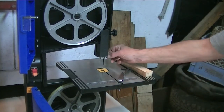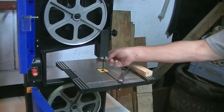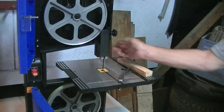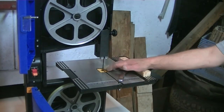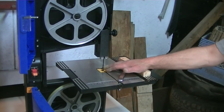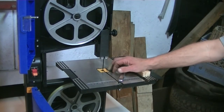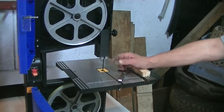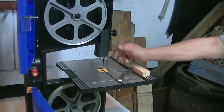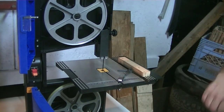And these little finger joints will wear over time, so you have to keep an eye on them and adjust them once in a while, because if everything else is good and you're getting bad cuts, like it's not cutting straight enough, then these have probably worn in. So I would suggest running maybe a few days worth of cutting with these settings, and then going back to double check and retweak them, because these pins have to break in. Check all three of your settings, 1, 2, and 3. Make sure they're all still at 2,000ths.